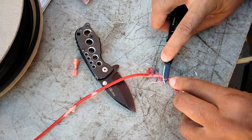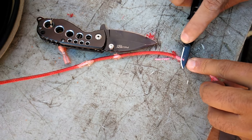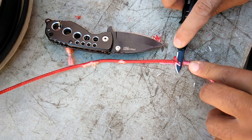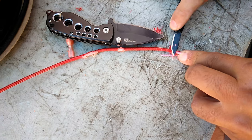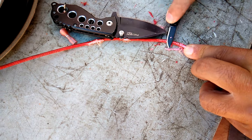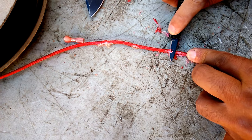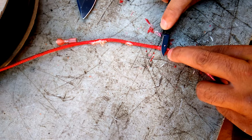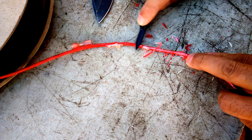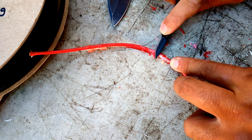I'm being very careful getting this to go through here. This is a pretty sharp blade — you definitely want to use something about the sharpness of a razor. Try not to bite into the insulation underneath because it's two layers: this heat insulation and the actual wire insulator underneath. You can see I'm getting through it and just stripping it away.